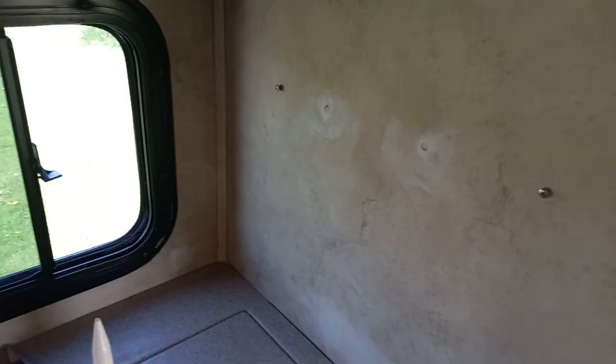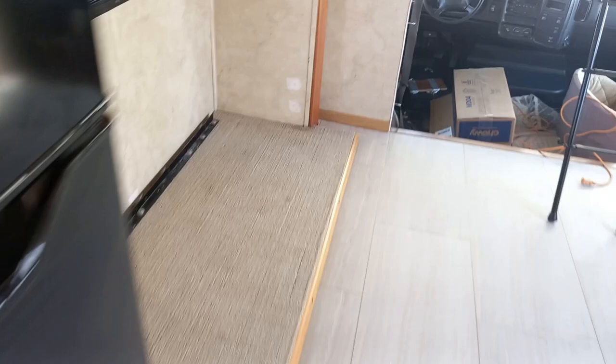So our pink-to-white spackle is dry in a lot of places, so I'm just going to hit it quick with my sanding block and knock it out. I just go by feel and we will get all these sanded quick. Once it's sanded, I always like to just go over it with a cloth to make sure all that loose dust is off. And then you also need to sweep up where you've sanded because you want to work clean. Any dust or anything on the floor might get into your paint, so you want to make sure it's all clean.